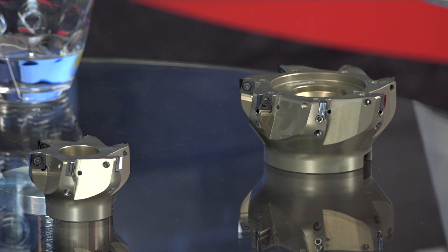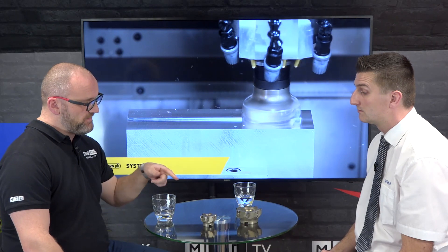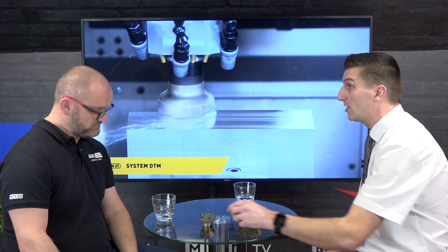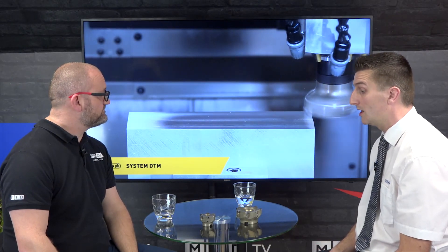The smaller cutter — I think what's that, 50mm? — is great for large turning centres, maybe with the Y-axis driven tools, for removing material. Yeah, definitely. What is the max RPM? We've got balancing holes, which normally tells you these tools can run fairly fast. That cutter there is 18,000 RPM, and you've got balancing holes to make sure you've got the tool running true.